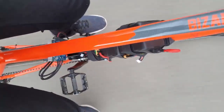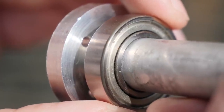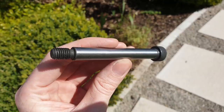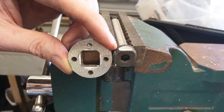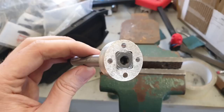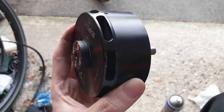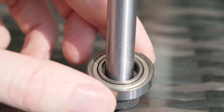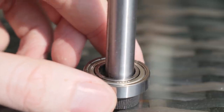The vibration was due to my amateur lathe-turning skills — I'd machined the shaft slightly too small, leaving play in the bearings. My workaround was a 12-millimeter shoulder bolt. These bolts have a shaft section machined perfectly to fit within bearings. I filed down the head to lock into an aluminium bracket cut on my CNC router, sprayed it black, bolted it to the motor, and cut off the threaded section. I then replaced the bearings in the motor for 12-millimeter inside diameter rather than 15-millimeter, giving a motor shaft with zero play.